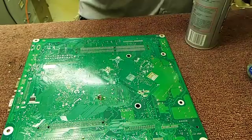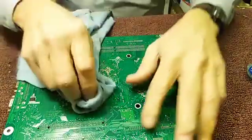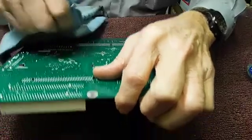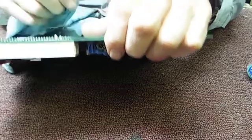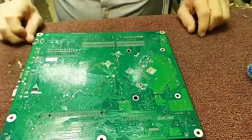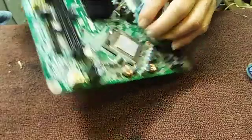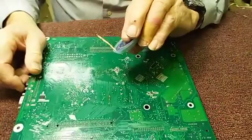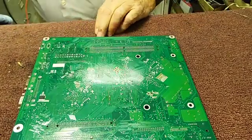I've got flux on here. I'm at work, so I don't really have all of my neat little tools that I have at home — like scrubby brushes and things. That flux is kind of gooey; I've got to get some better flux. These are all 1800 microfarad, so we can just pull them out. Alright, so there's one way — with solder wick. It works, but it's not great. Let's try another way.